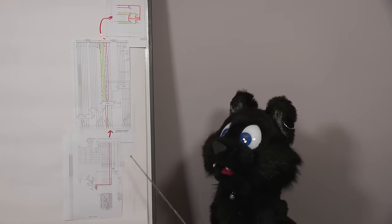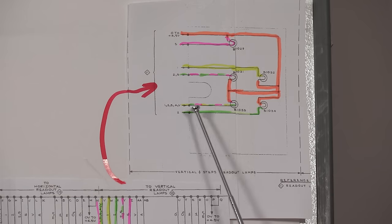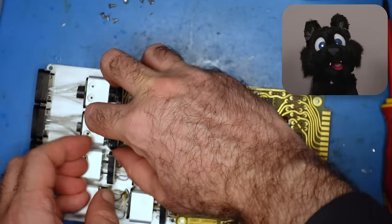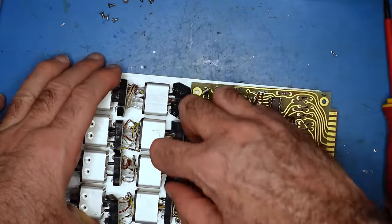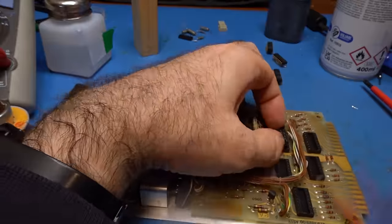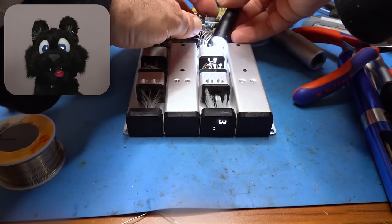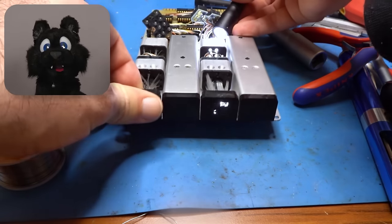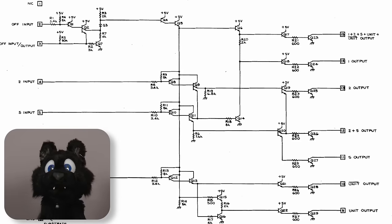Now the readout board takes these signaling lines and the ICs perform some custom logic to drive little 5V lamps according to the patterns that should be shown. Yes. All these wires from the ICs to the shielded blocks are connecting little incandescent bulbs. Each lamp shines its light into a bundle of fiber optic strands, and those are put into their designated hole in the front. That means that each light bulb lights up a fixed set of points. The chips use open collector outputs to pull the lamp lines to ground.